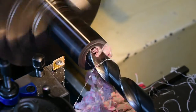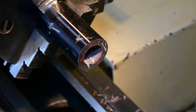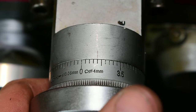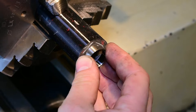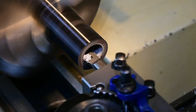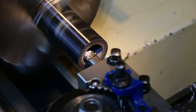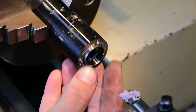First I'm using a large drill to remove the bulk of material on the inside. Then I'll switch to an internal chisel and slowly creep up to the diameter of the ring core. The final cuts have to be very precise, so I'm only removing 0.05 mm at a time, always checking with the core after every pass. If the diameter is too small, it obviously won't fit. But if it's too big, it'll be next to impossible to glue the two parts together correctly — there will be too large of a gap that's gonna trap air, and besides looking crappy, it'll compromise the bond.